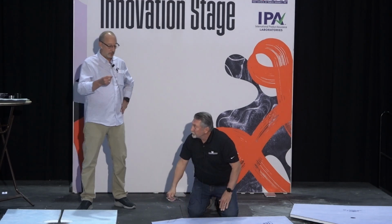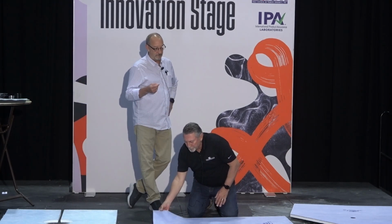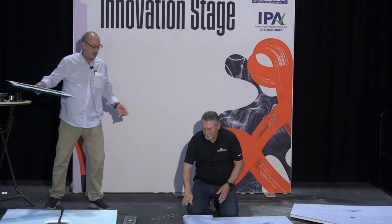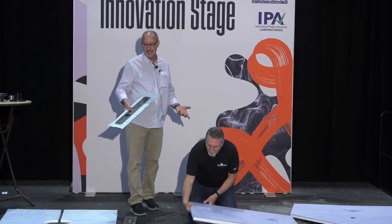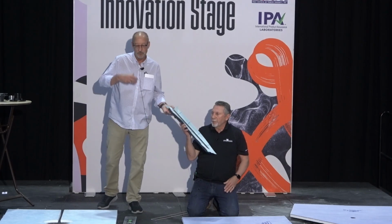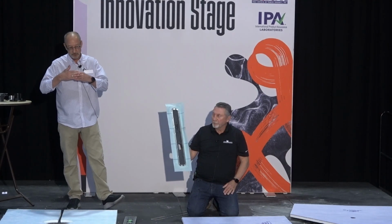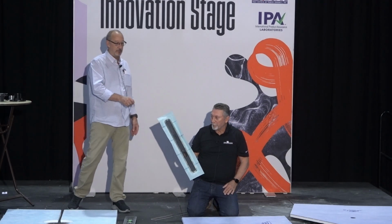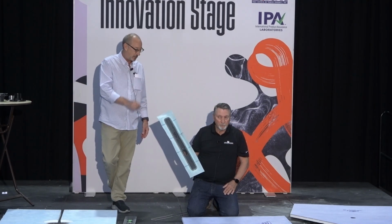If you've noticed, being a waterproofing company, first and foremost, we do believe in clamping rings for drains. We really don't like to see a situation where the membrane is simply caulked or sealed to a drain body. There's so much expansion and contraction taking place over the course of the lifetime. People are starting to see some of the fabrics coming loose from the drains. The clamping ring is that mechanical connection to make sure that it stays there.